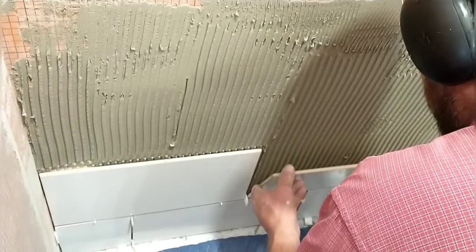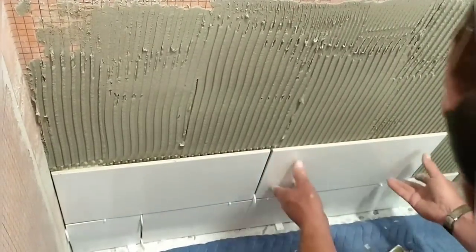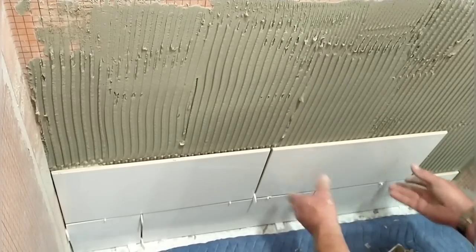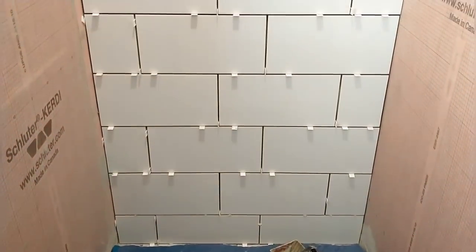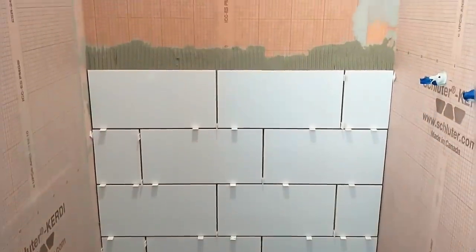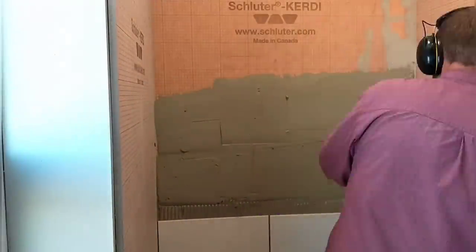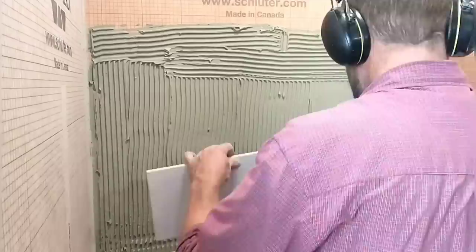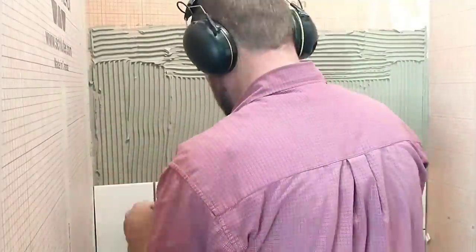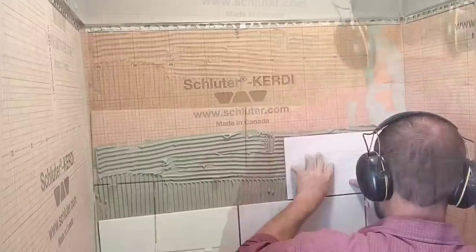With the hard part done this is going really fast. I'm able to use two tiles uncut and only cut one on each side, then just alternate which side the cut one is on. The size of the cut tile stays the same all the way up, so I can cut several to that same width and then it's just like stacking bricks. I'm only going up to within about a foot of the top, leaving that last foot open because we're going to be changing tile to a more colorful and interesting pattern along the top.